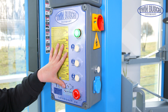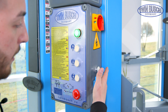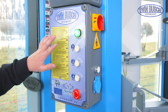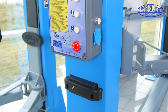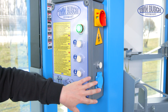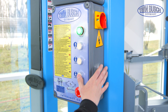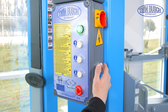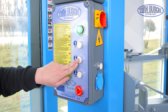Now at the control unit, there are some differences compared to the Basic Line. All Profi Line models have a 230 V connection where I can connect my angle grinder or any other tool. This control unit also has an up button, a down button, and a lock button like the one from the 242-E. We can clearly see the electromagnets — there are two on each post, responsible for the electromagnetic safety release. Something special to the Profi Line is the anti-lift-up-button system. When you push the down button on hydraulic lifts, the lift normally goes up a bit first before moving down — this is not the case here. If I push this button combination first and then the down button, the lift goes down directly, as long as it was not lowered onto the locking position before.